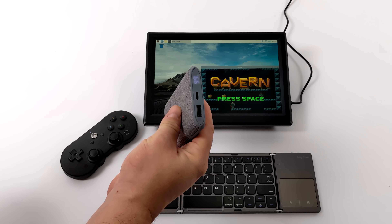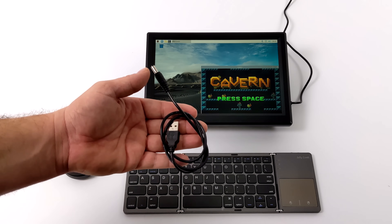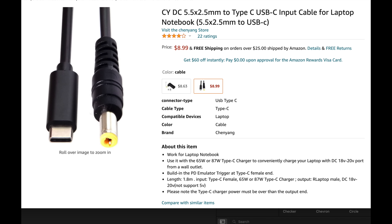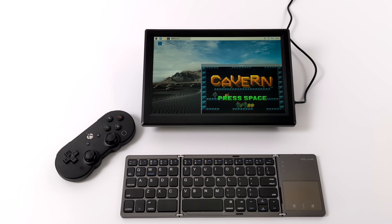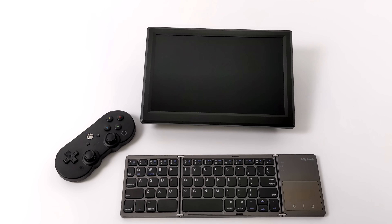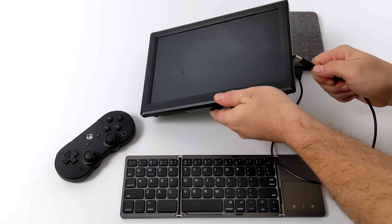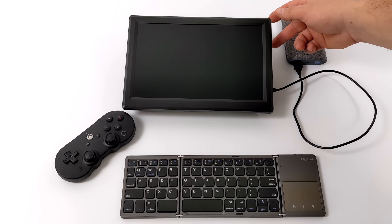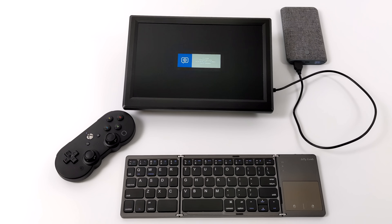Now I want to show you that this whole setup will work over battery power. What I have here is a 10,000 mAh little phone charger — a battery bank. I also have this little adapter here: full-size USB on one side, 5.5 millimeter power jack on the other. But personally, I would recommend something like a USB Type-C to a 5.5 millimeter power jack — that way we could send a full 5 volts, 3 amps out of the USB Type-C port. Even over the cable I'm using right now, I have not experienced any kind of cutout or low power indicator on the Raspberry Pi. The power bank I'm using is an inexpensive ONN-branded one from Walmart, and I personally like these because they have that little LCD charge indicator letting us know how much is left in the battery.